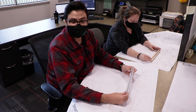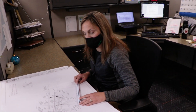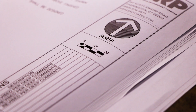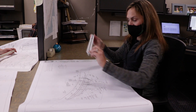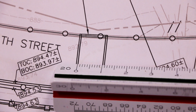The scale does that multiplication for you. For example, if I wanted to figure out the length of a certain item on my plan, I would look at the scale — which in this case is one inch equals 20 feet — I would look on my engineering scale for the 20, and once I see the 20, I measure: this culvert, for example, is 10 feet wide.